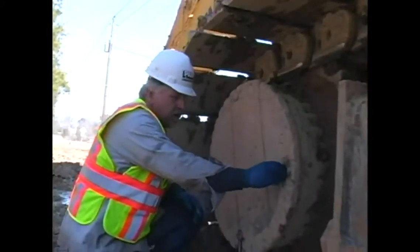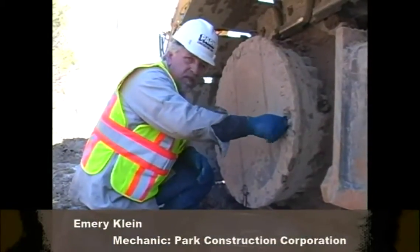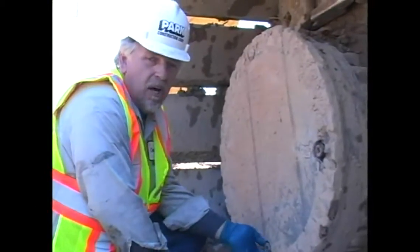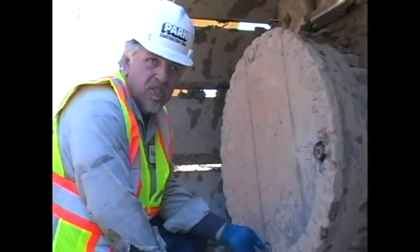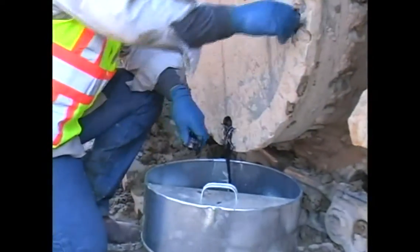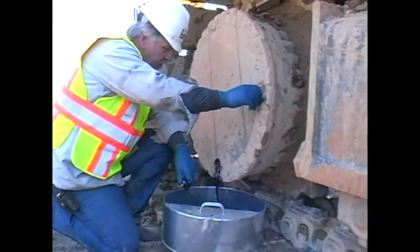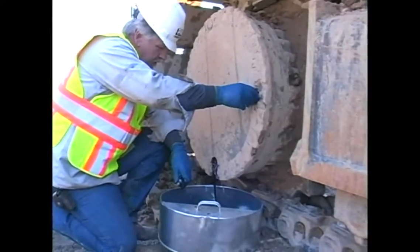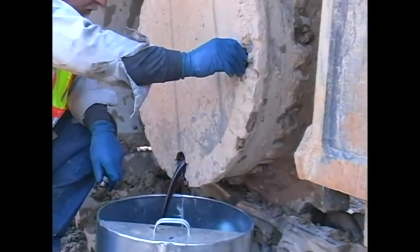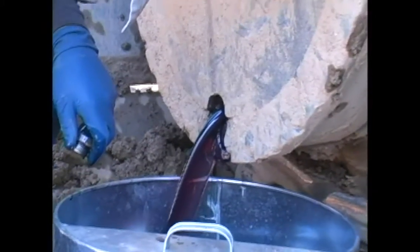When you pull those samples on an excavator, you want to do a sample every thousand hours and change the fluids every two thousand hours. Once you're done, screw the top cap back in — it'll slow the flow down to start draining. Screw your bottom plug out first, then remove the top plug. The amount of flow you want coming out determines how much you screw that plug out. Once you start letting the air in, the more you pull the plug, the more fluid flow you'll get.